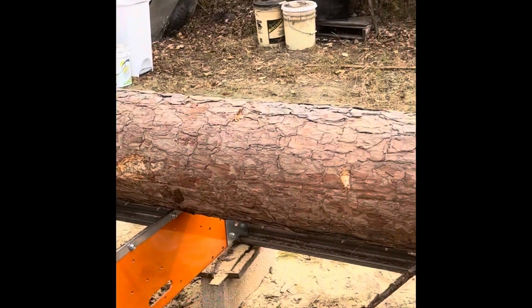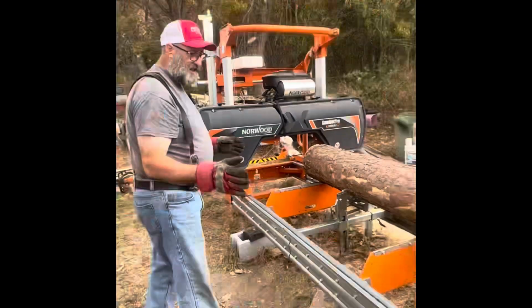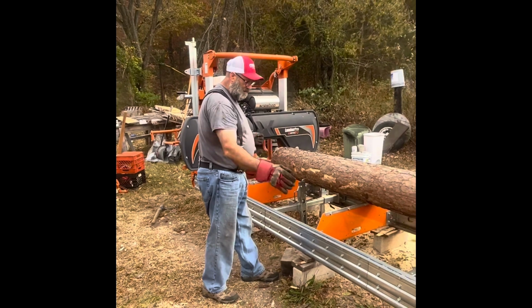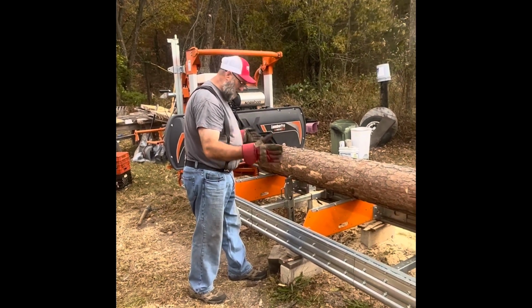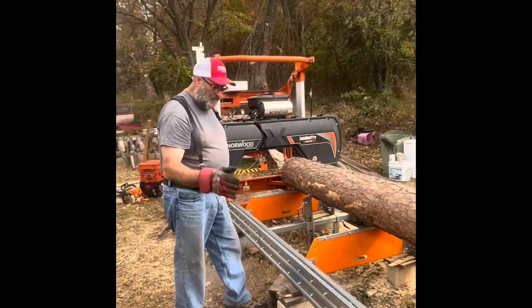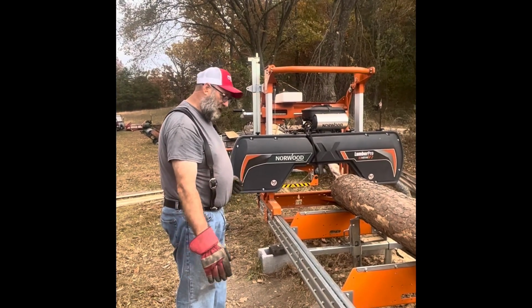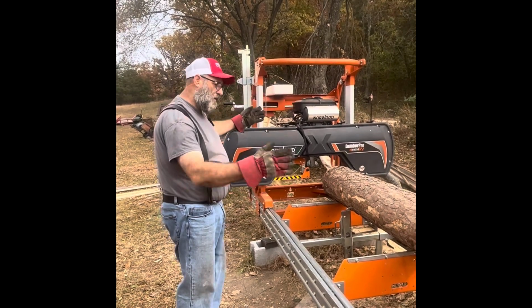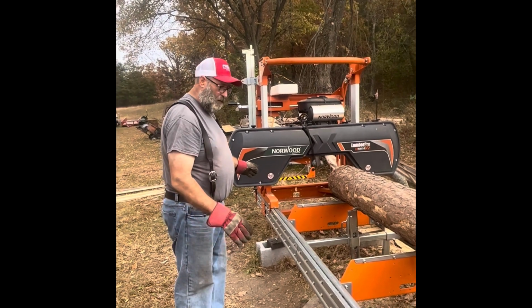If you had a mill that you're doing a lot of 8-foot stuff on, you should have them at 6 foot, somewhere in your bracing to where it's 6 foot apart. There's nothing wrong with this mill. But the old man had been cutting a lot of logs, and he told me there's a reason why. If you get it out to the edges like that, it won't teeter-totter, and you won't have to worry about this dip that comes through it when you're doing this on 4-foot sections.